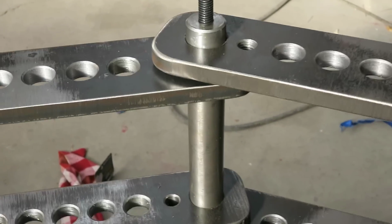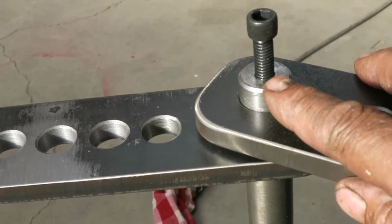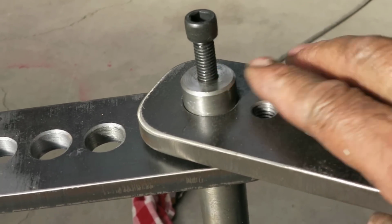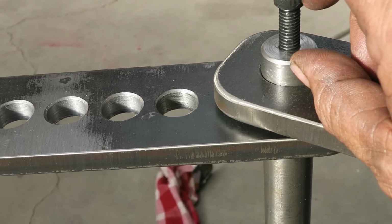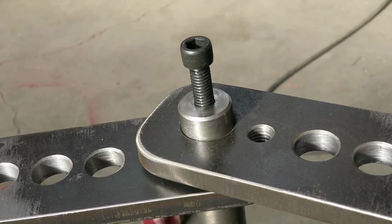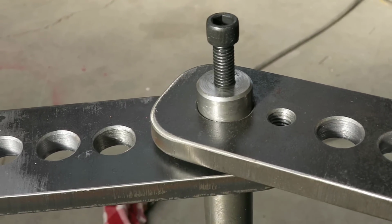I don't know how well this will work, I don't see why it wouldn't, but instead of making a bunch of these pins, if you needed a 1/4 inch diameter or radius up here, that'd be the diameter, for bending small stuff when you're working on top. They want you to leave a 3/4 inch piece here at whatever diameter you want to bend. I thought it'd be a lot more universal doing it this way. And I guess if it doesn't work, we'll go back to their design.